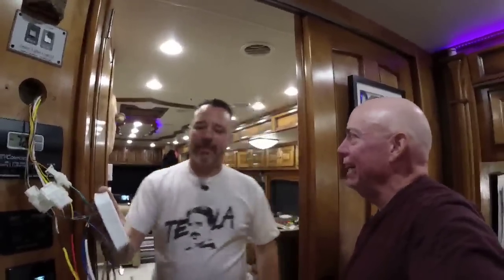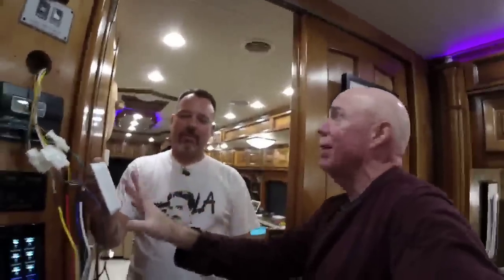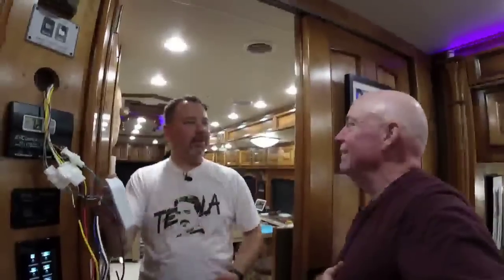It probably tried to turn on the heat pump, which we shouldn't have had on in this place, on this thermostat to begin with. Well, this one we can. Yep. Aqua hot, different thing. But it tried to turn on the heat pump, which it can't do. Yeah. We have successfully installed a thermostat. It was wired properly. We just got to mount it to the wall next. Yeah, that's the next part.